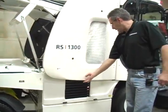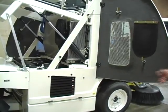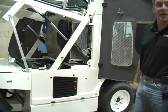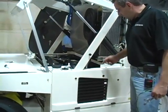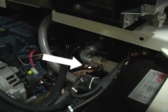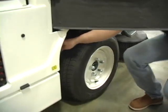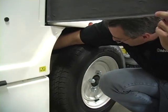I'm going to show you the area that we're going to be working in today. I already have the hopper raised for our ability to take a look down at the area that we're going to be working, and I have the engine cover removed. Down in this area here, I've got a light shining on the location that has the RPM sensor. Just behind the front wheel, I'm going to access that RPM sensor and remove the two jam nuts on the top of the RPM sensor that are currently installed.